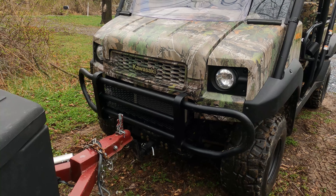I have no idea if it'll hold. Last thing before we wrap up: the whole project was a failure. Here's why — as the mule was pulling forward, the hitch had a lot of flex. I mentioned getting 3/16-inch steel angle iron welded to the frame. It bent. It's flexible. The cross bar between the two front frame pieces — I thought it would be strong enough to bolt the hitch to. The hitch itself is very strong, no problems there. But the piece it's mounted to bends and flexes. I have some pretty good ideas of how to reinforce it — basically a couple pieces of plate going from the top of that angle back to the actual frame itself. Should take care of it, but that's for another video. Thanks for watching!